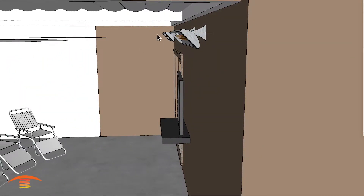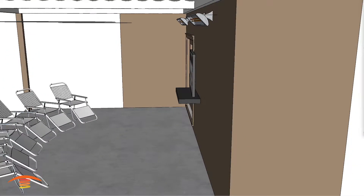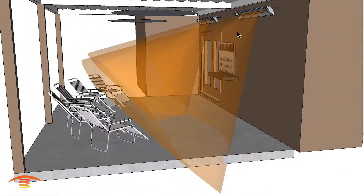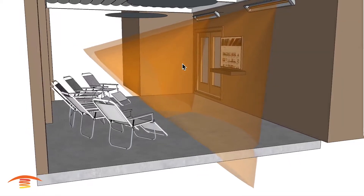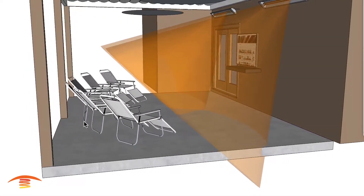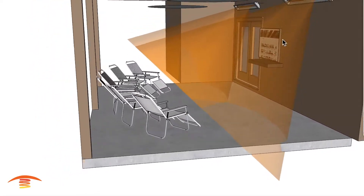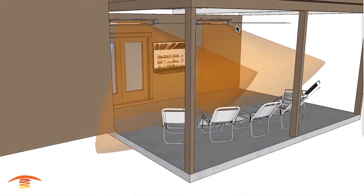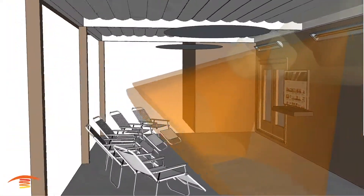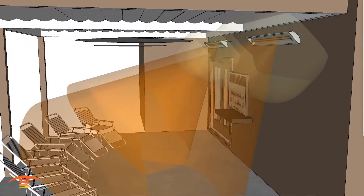I have this out at roughly about a 25 degree tilt down. Normally I'd go with 30 degrees, but you could go with 20 degrees here — we would try to get the rays out as far as possible. This is the ideal footprint of heat. This light does travel; infrared light is invisible to the human eye but it does continue to travel. However, I don't believe that the distance away from the seating area is ideal for this pattern of placement, and it would not be my first option. We are still meeting the clearance to combustibles with the fans, so that should not be an issue.